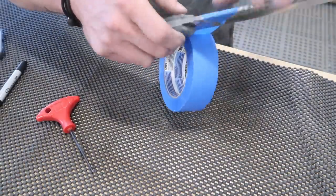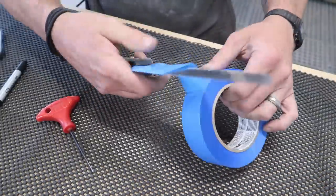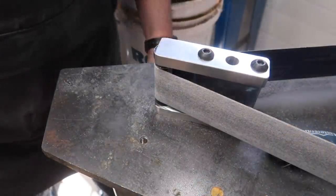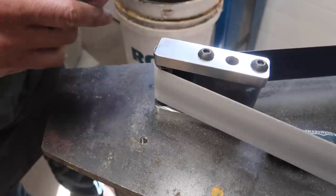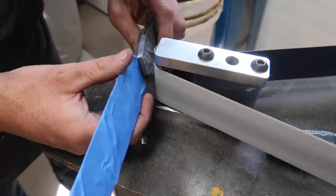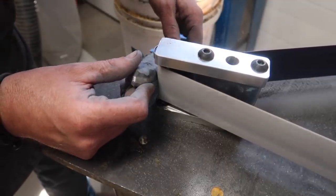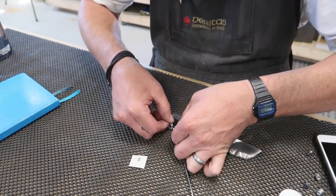Before I do that, I protect the blade with some masking tape — I'd hate to accidentally touch it with the belt and ruin something at this point. We'll get it assembled, tape it all up, and then continue. Essentially I'll pick one of the grooves I had left off with and roll that around the tang of the knife, continuing the rock patterning. I also switched to a smaller wheel here, which really helped — with a bigger wheel I wasn't getting the results I wanted. I used several different wheels to give it a bit more of a random rock pattern.